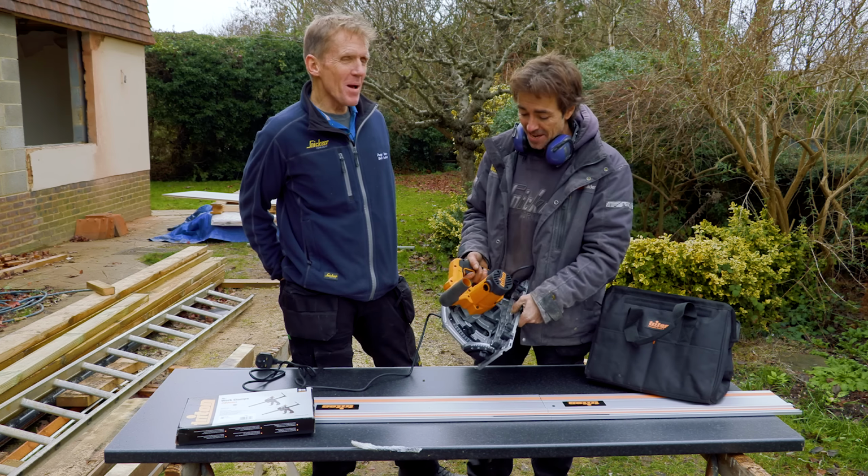Now let me just tighten those back up because I've just been beveling with it without a lot of success. You can't actually do a bevel cut on a 40mm worktop. No, probably won't have the depth of cut. It doesn't, no. Might only have about 44mm or something like that, if you're lucky, but when you're on a rail you lose a bit. Right, let's give this a scribe cut.